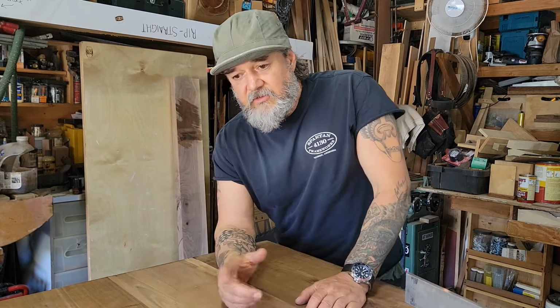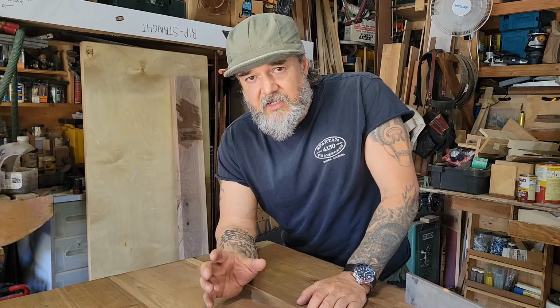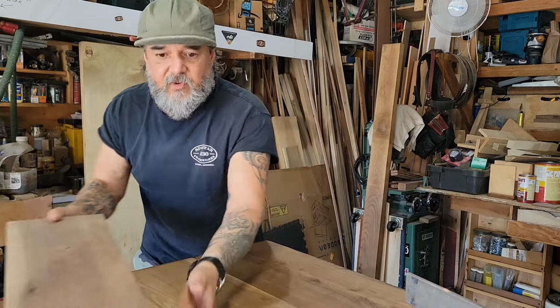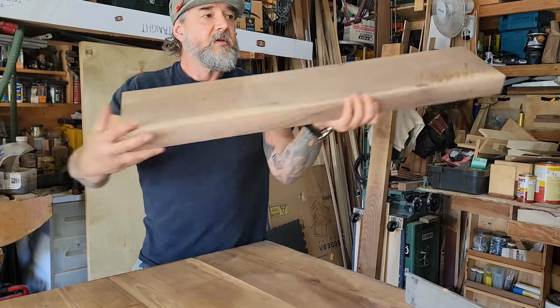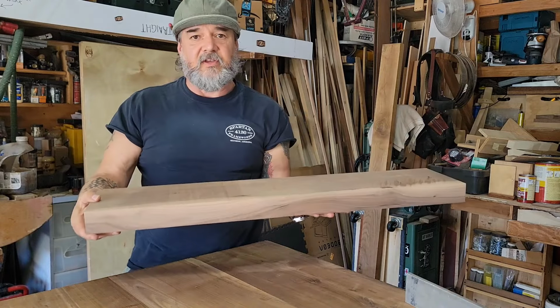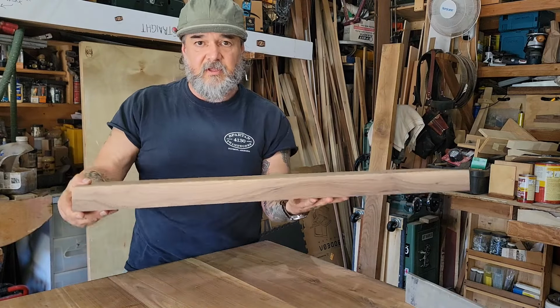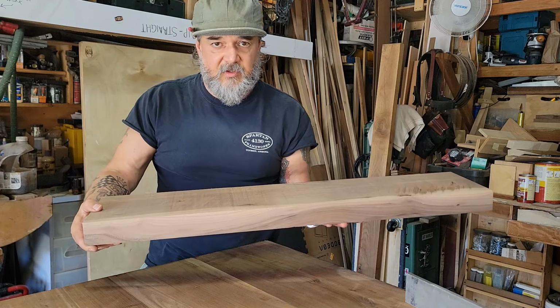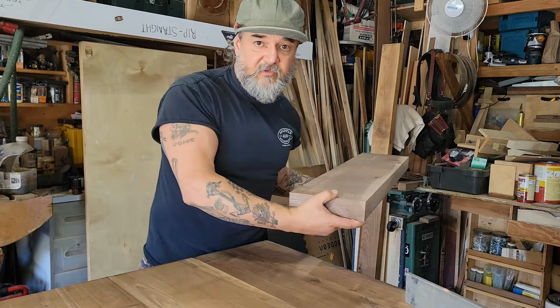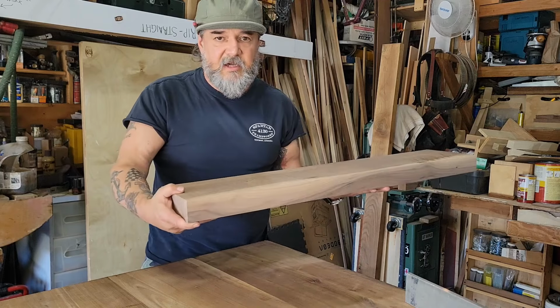If he had a guy doing what I'm talking about, and did the preliminary milling first, we got every board just like this, face joined, edged, resawn, stacked. Now those boards are going to sit and they're going to stabilize. They're going to move a little bit, right? But now the guy who's going to build the table can come along, because that wood could be sitting there for months or a week or more. Now he could come and take it.